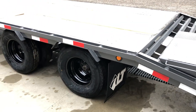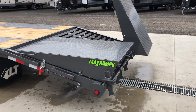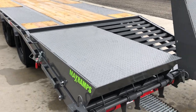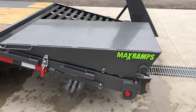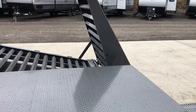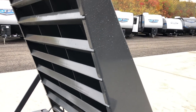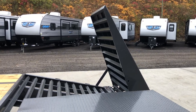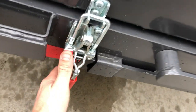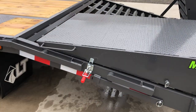Because we did the charcoal, this has black wheels with the charcoal powder coat. We optioned into full width ramps — one, they give you full width loading, and two, when you have them down they give you a full flat 30 foot deck. They've got a full tread plate backer on the back so you can load all the way out on them. Another nice feature: these have stand-up bars, not all of them do, and you'll see it stands the trailer pretty well upright. The treads are mounted raised about a quarter inch over the ramp so you get a little bit of traction — a nice little detail. They also give you a locking latch on these ramps so they're not banging as you're going down the road, plus a nice big grab handle.